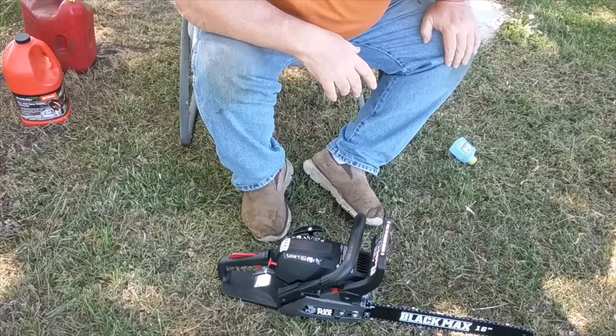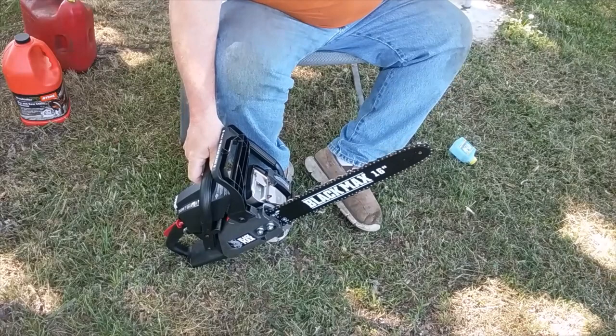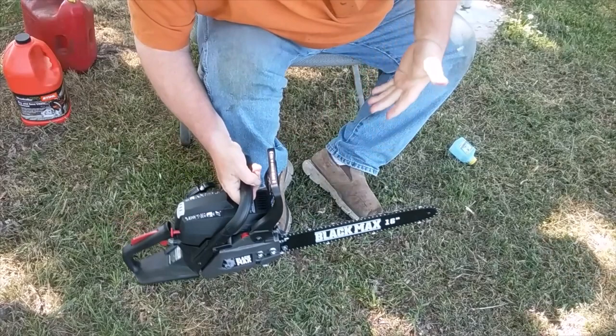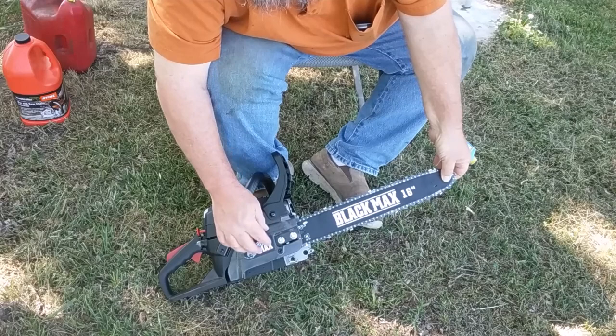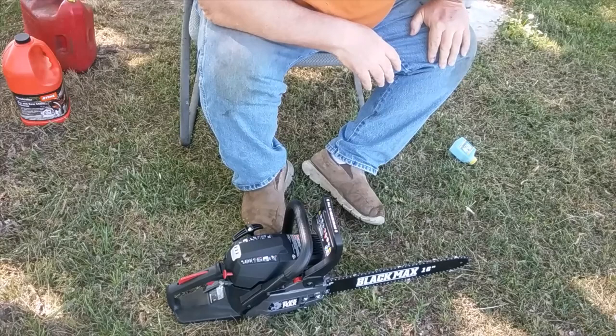The cover has to go straight in instead of coming in from the top. I did take the tip guard off — do that at your own risk. It does have grease on it, and you have grease points for your sprocket here. This is a low-profile chain, it's a .050 chain. To adjust chain tension, take these two nuts loose — this is your adjustment right here. Hold up on the tip while you tighten or loosen, and once you get it where you want, tighten the nuts back down.